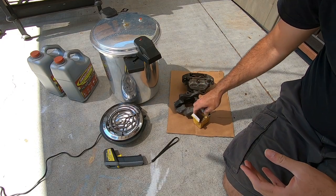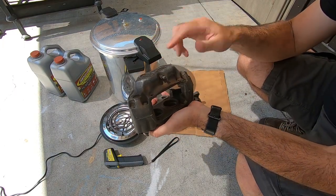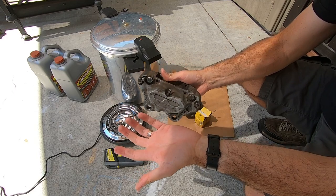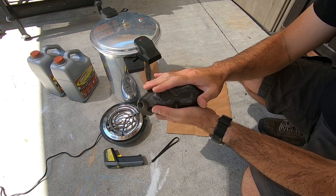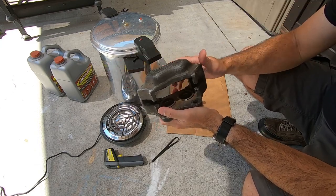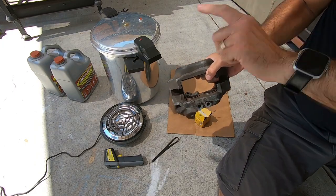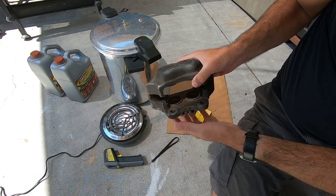So how I'm going to do that involves understanding rust. The process of rust is oxidation — oxygen combines with the iron in the steel and it's an exothermic reaction, which means it heats up and releases energy. In order to get the rust off without mechanical grinding, I'm going to use a vapor rust, which chelates the iron and removes the oxygen. It works a lot better if you're providing energy in — this reaction to remove the oxygen is endothermic, requiring energy in the form of heat.